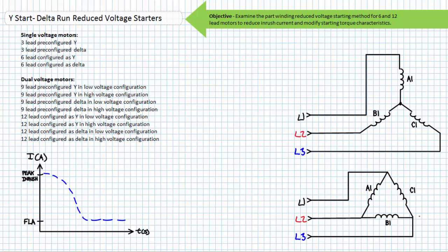After we've discussed timer relays, expect to revisit reduced voltage starters incorporating timers in later lectures. As you'll soon learn, the term reduced voltage relies upon some mathematical trickery; however, the effects are the same. When this technique is employed, a motor experiences less of an inrush and accelerates gently in comparison to a full voltage starter.